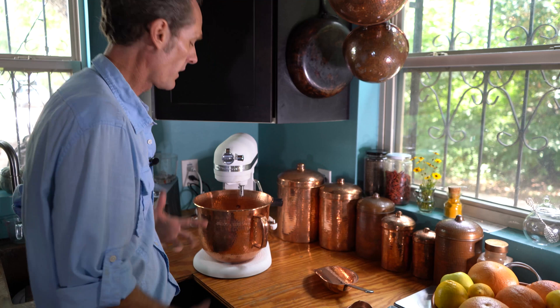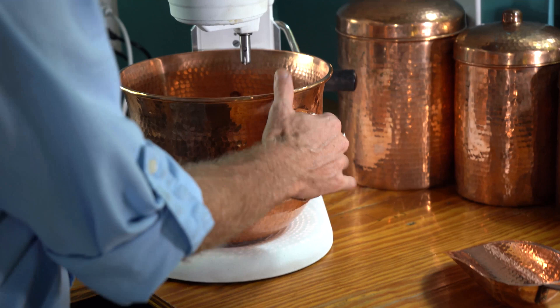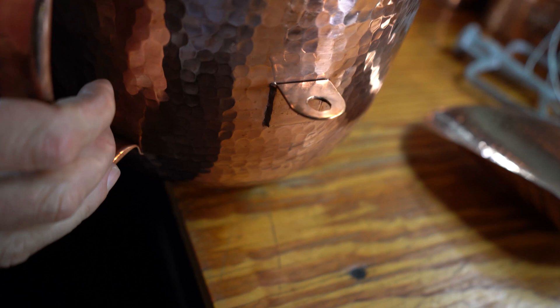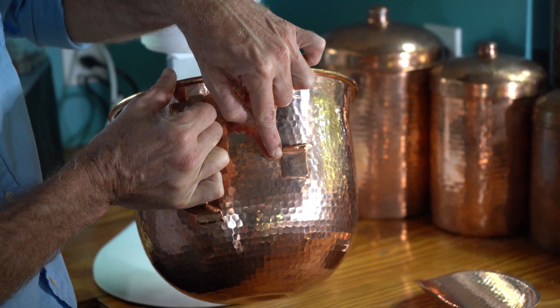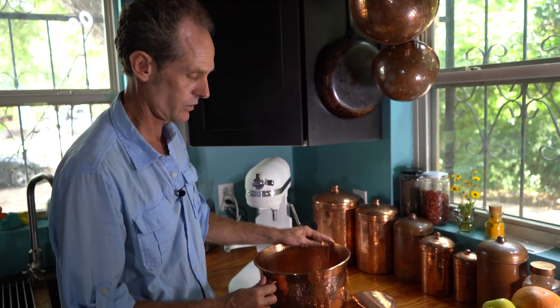It's a similar thing for copper, which is where we anneal it — which allows for more elasticity within the copper structure. And basically what we did here, we just made this piece. You've got your dog ear tabs. We have TIG welded these dog ear tabs on there. This is a TIG welding process that basically unifies the copper — it melts this piece and this piece together, and we add a little piece of copper wire and weld it all together so you have one solid piece.